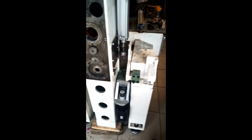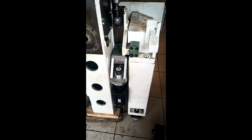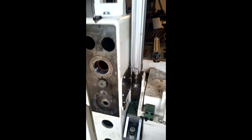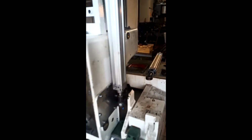so that the servo does not have that much heavy lifting to do. That's a quick view from the back side, where you can see the DMM servo fitted with a belt drive and the ball screw fitted just behind it. Now, of course, those are dovetails for X and Y, and there's a boxway here in Z.